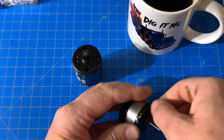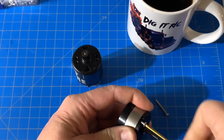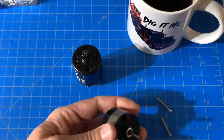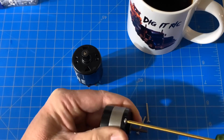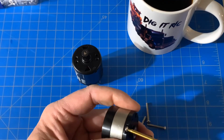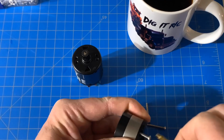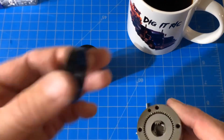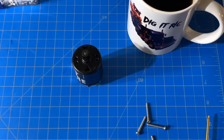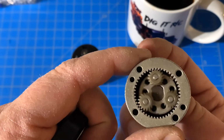So we're going to take, we got to pull this apart so that we can get that motor mounted. We'll get all these screws out. I'll just be careful because that's holding everything together here. So I just want to pull this piece off right here. Whoop. See, drop that ring. So be good to take a look at that. You know what? Since it's apart, it'd probably be a good idea to grease that up too.